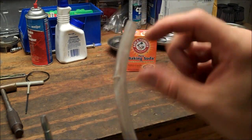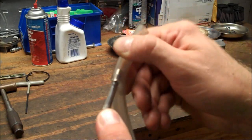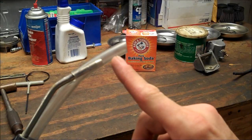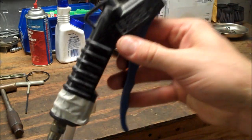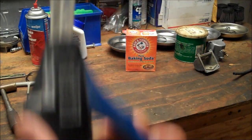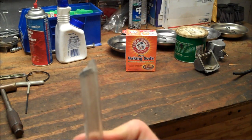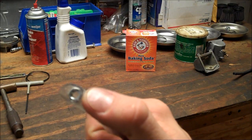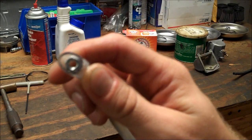What I did is, about two inches from the end, you just cut a little hole and poke your blow gun through there. Make sure it's about an inch or so recessed in there, and then just tape the hose to your blow gun so you can use it easily. Down here I cut the end at a 45 degree angle. At first I had nothing down here and it sucked up way too much soda way too fast, so I put a little nut in there as a restrictor.